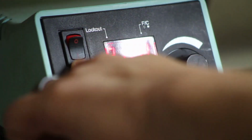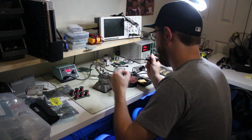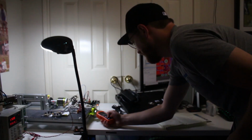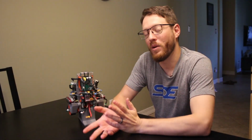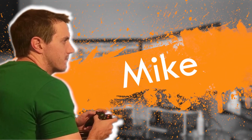James ties it all together, weaving the mechanical systems and electronics together to ensure Bobble-Bot had everything it needs to stay upright. The Raspberry Pi is going to execute certain software at very specific times, so we make sure it stays balanced. Being precise and exact, the only way to really do that in the computer software is with the real-time kernel. And Mike works on the control software, which took a little while to perfect.